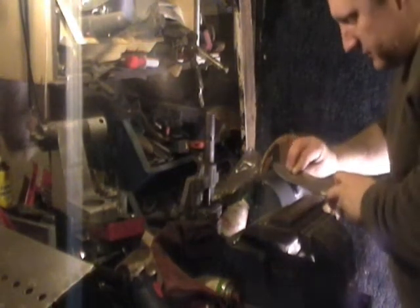and then that, can you see all those straight lines, vertical lines? That's the disc going like this, and then that top edge, which is a different looking line, that sort of 2 millimeters of silver you can see there, that's on a stone. So I'm going over to the stone, which I've mounted in a vise. Should be able to see it right there. Okay, got a drop of oil on it. And what I'm doing is, I'll do it about the front so you can see.